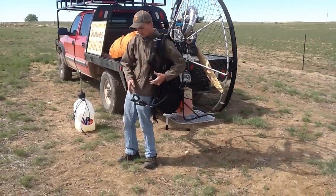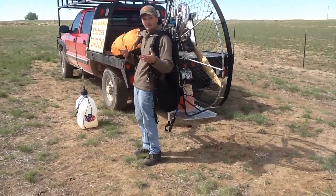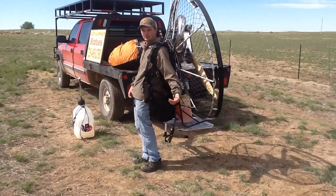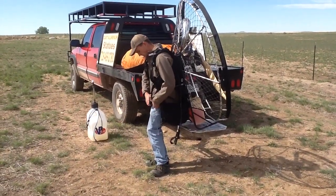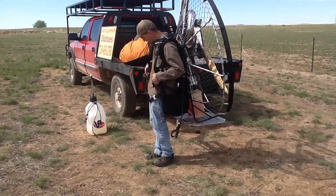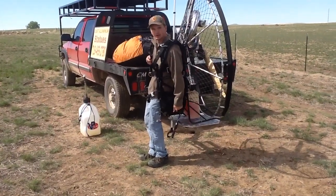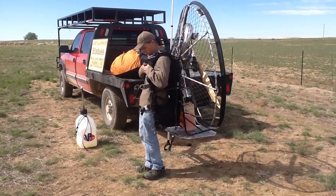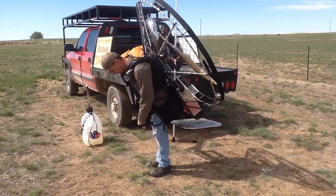It's as simple as can be. I used to set my paramotor on the ground, get into it there, then have to stand up, and I was never very comfortable with that. With this, you're letting the paramotor plate support the whole paramotor as you strap in. With this particular unit — it's a high hooking machine with hard J bars — you've got to kind of lean the paramotor forward to strap in. I also have a low hooking machine that you basically set down on this plate and strap in that way. It's actually a little easier to get into a low hooking machine with this plate, but as you can see, a high hooking machine is very, very easy.